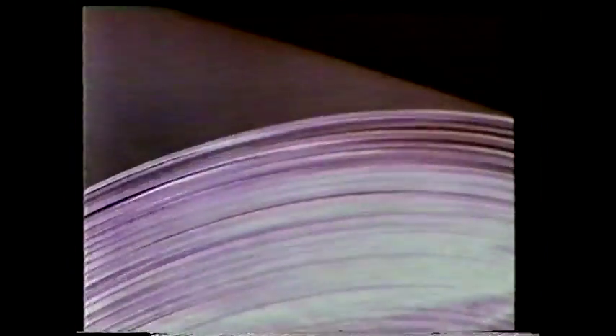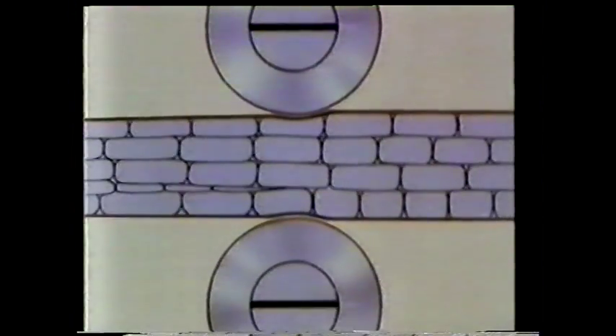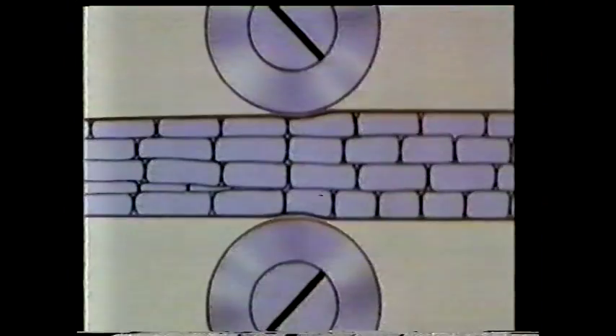The bright, clean coils, protected against corrosion, go next to the cold rolling mill, where they're reduced to the required thickness. Typical is this five-stand mill, which passes the coil through a series of rolls in tandem. Each set of rolls is mounted in a four-high configuration. In cold rolling, the squeezing action of the rolls not only thins the sheet, but also alters its structure. It imposes on the strip an elongated grain structure aligned in the direction of rolling. Because no heat is involved, recrystallization and grain growth don't take place. The reduction in thickness is helped by maintaining the tension in the strip between each of the stands in the mill. In this way, the thickness of the material can be reduced to a few thousandths of an inch.